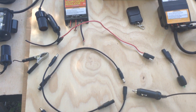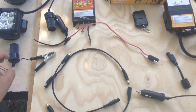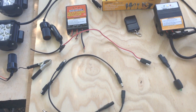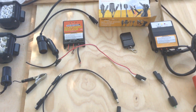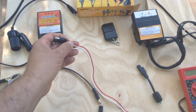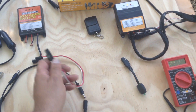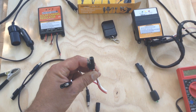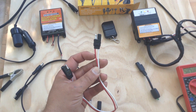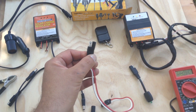On a system like this, you want to try to find stuff where these things are factory installed, because if they're not, you've got to choke up on the wire a little bit and do some clipping and splicing. You end up with either shrink wrap or electrical tape. What's generally going to happen on any pass-through device is our positive always stays on one side and negative on the other, but the two plugs are different. The little one sticking out here is the positive — the red — and over here the little one sticking out is the negative.